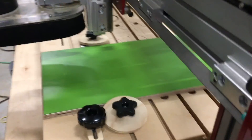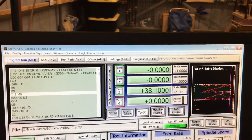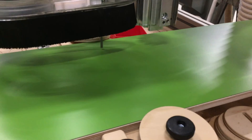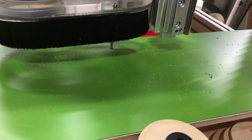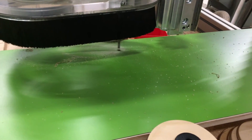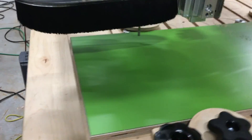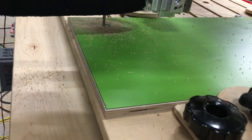Here is the top of the box beam clamped in place on the CNC machine. You can see it's supported on the outfeed side with a roller table and registered against the parf dogs. Here's the program in Mach3. It runs the drill operation first — you'll see it move down and drill the locator hole for the next operation. It's a deep drilling operation where it keeps pecking out. This is a downcut bit, so pressure builds quickly. There's the deep drilling operation, drilling that locator hole — it doesn't need to go all the way through; a quarter inch deep is enough. Then you'll see it move down and start drilling the first series of 20mm holes for the clamping system, doing a circular interpolation operation in Fusion 360, drilling all the way down until the center pops out.